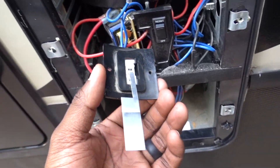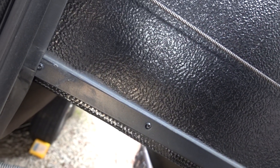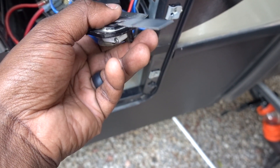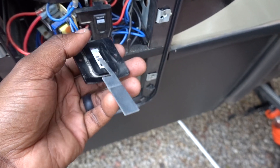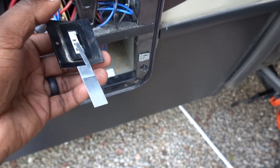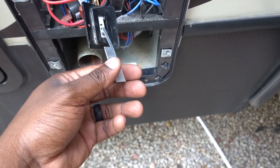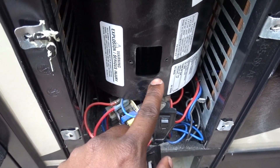I pulled all the dust off of this thing — be very careful. That clicking sound you might hear: there's a little button, and when the fan turns on, it basically initiates the sail switch by pushing it, and that's what allows the furnace to light. Just make sure all of this is nicely cleaned out. This is a very sensitive part, so you want to be very careful — you don't want to break or bend this because you could affect its performance. I do notice there's some dust on the outside of this cover and I'm wondering if it's because this isn't sealed correctly.